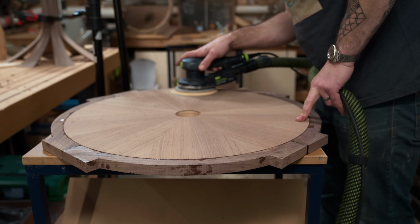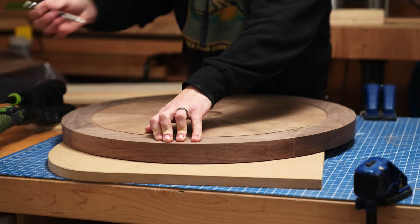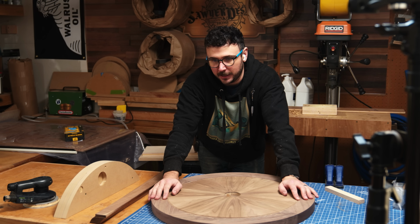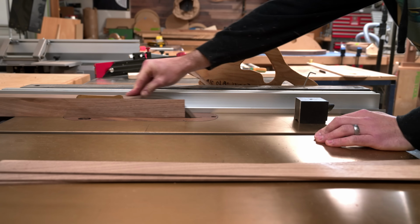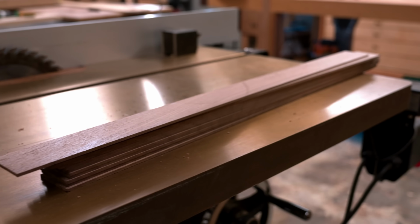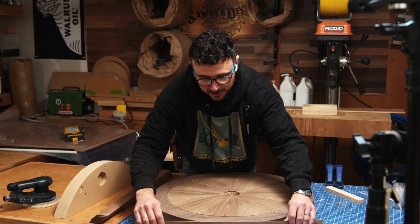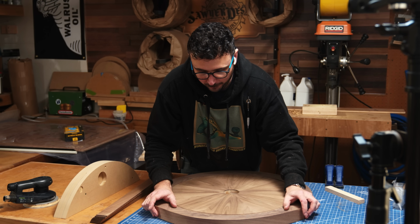Inlay would be black to kind of tie in some of these complements from the top. I know Cam will, 99.9% chance of him using black epoxy in the top. So I think there's some visual interest I could add by adding basically a black ring around the outside. I've cut these, we'll ebonize them, and they'll set around the edge. So get that in the vacuum bag.